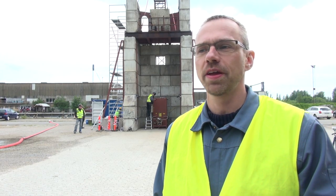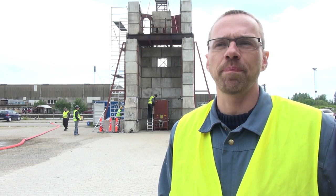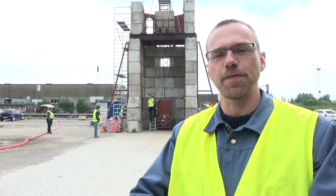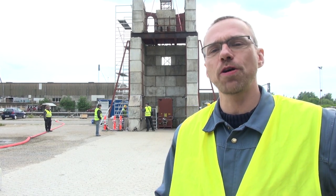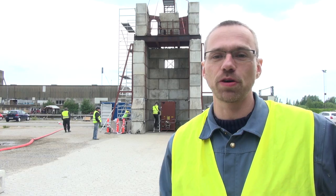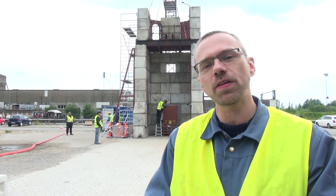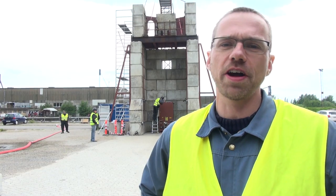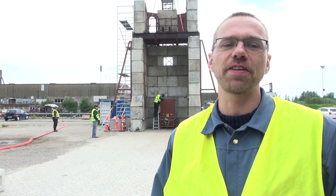It burns much hotter, around 2300 Kelvin, where Sapphire was around 1000. On the other hand, the thrust is lower, so there's simply less of a mass flow for the jet vane to withstand. And ultimately, the burn will be much longer. Sapphire was burning for 11 seconds, and we would like to run the BPM5 for 50. So combining all these differences, it wasn't obvious beforehand whether a copper vane could actually take it or not. So we gave that a try, and the tip melted off.